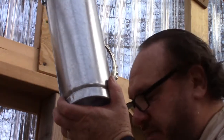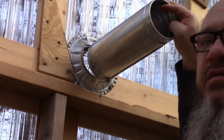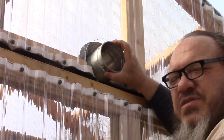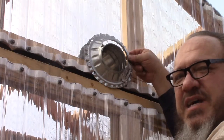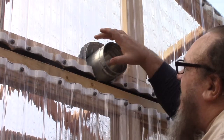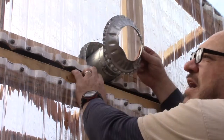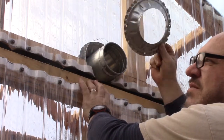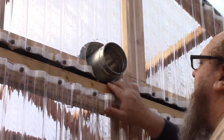I'm going to take this short piece outside and attach the other side, feeding it through to make sure they're both lined up. My bolts might be long enough, but I'm going to leave this off for now because I'm not sure the exact angle the pipe is coming through. I'll attach the pipe to the heater, run it through, then slide this over the top and attach the vent that way to make sure it lines up. The only thing I'm worried about is I might need to cut off a little bit of the bottom right here - because this is a door or window that lifts up and I need to make sure I don't impinge on that.